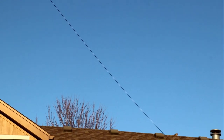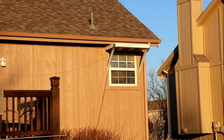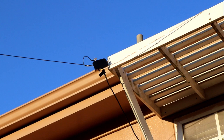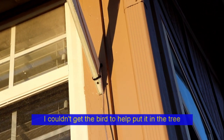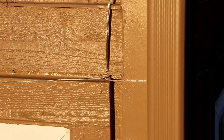I've got the antenna just strung up in a tree in my backyard, and it's a slope configuration. I've got the unun unit that's part of it down at the window sill on one corner of the house. I put this antenna up in the winter, so I really didn't spend a lot of time outside setting things up. I ran a couple of counterpoise wires and just used some speaker wire for that, and split it partway down from the unit. There is a screw terminal on the unit to add counterpoises or a ground.